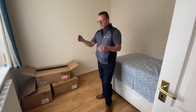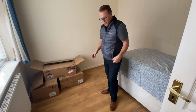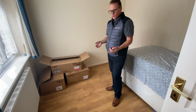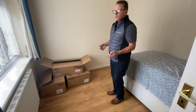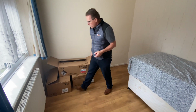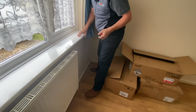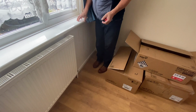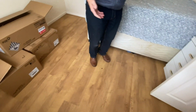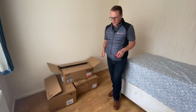When we're outside, we can see the air bricks that are around the property, and that's to ventilate the subfloor void. The floor has a laminate finish, but the actual floor structure is timber. We can feel the hollowness of the timber floor. What we're looking at in our inspection is to go to some of the corners of the rooms and see if there's any spring, any issues or anything like that. We've done this in all the rooms and it's pretty sound.